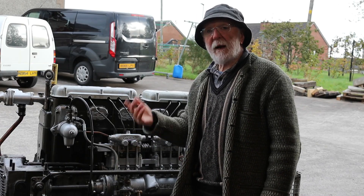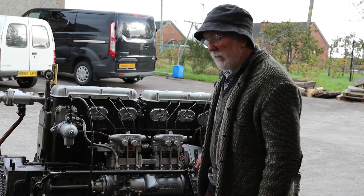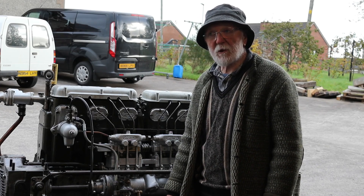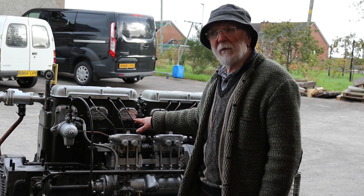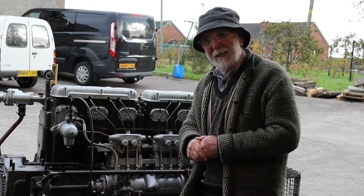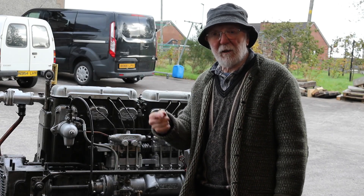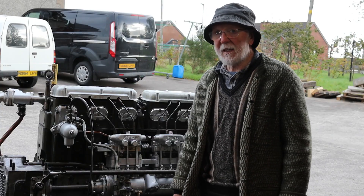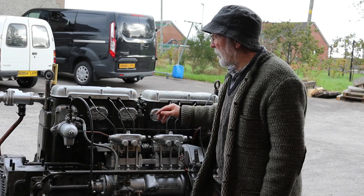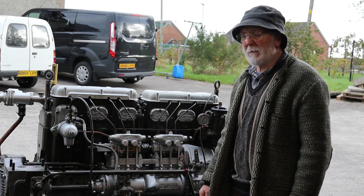We're going to fire up on six and then gradually reduce the number of cylinders firing. Hopefully she might go on one, though I think the lowest will be two cylinders. If the engine was smaller — a five, four, or three — I'd be quite confident we'd get her to run on one. But not a six, and certainly not an eight. An 8L3B will start on one cylinder and you can gradually introduce the others — that's a design feature of that engine. But it's a bit much to expect a 6LXB or certainly an 8LXB.